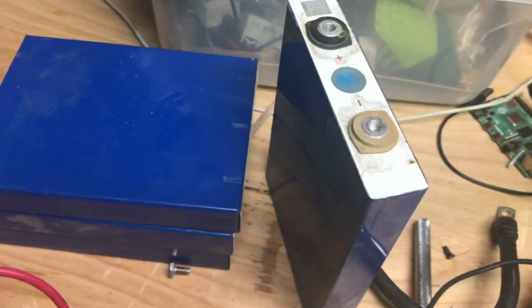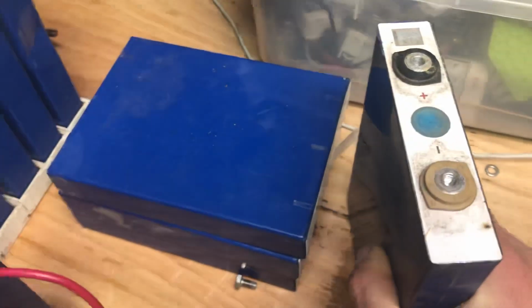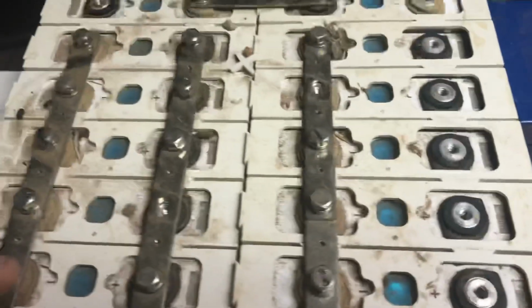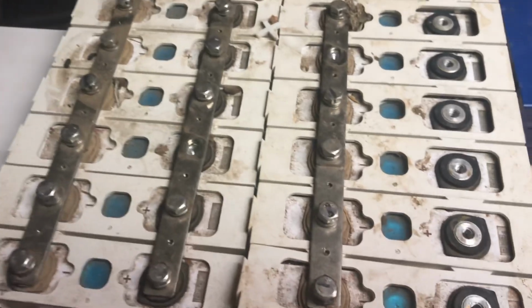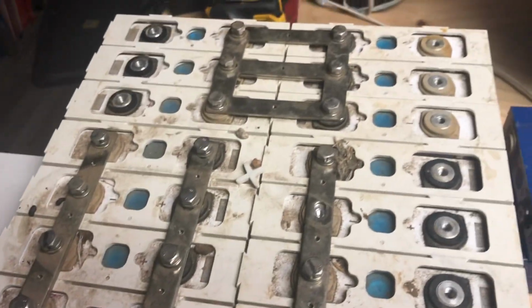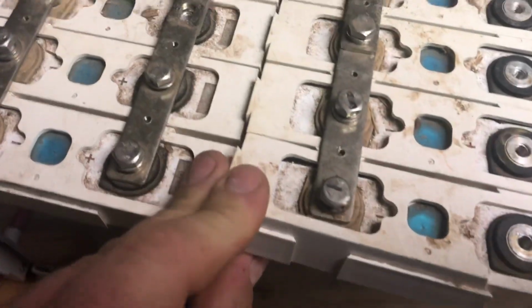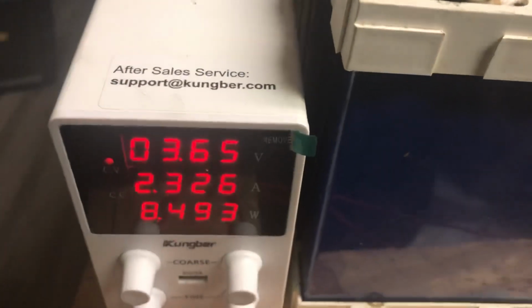And so if you can imagine, I'm pretty confident that a lithium ion equivalent would have been dead by now, and most certainly a lead acid. But this LiFePO4 keeps on humming 3 years later. Some of these other ones got drained probably because of how I had them configured. We had our jumper going across here, and we didn't have this. And so it was just asking for a slow trickle discharge. But you can see this thing was rode hard and put up wet, stored in the garage. It was moved around quite a bit, kept in the cold, and it's still holding that charge, and even holding it at nominal, which is incredible if you think about it.